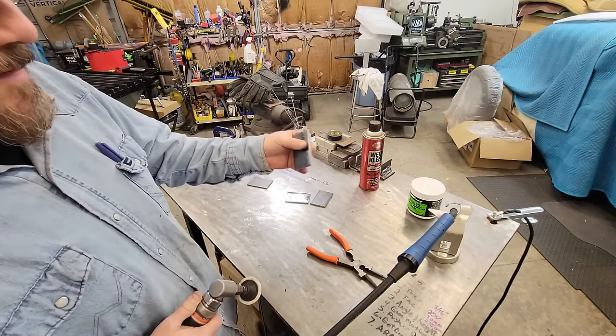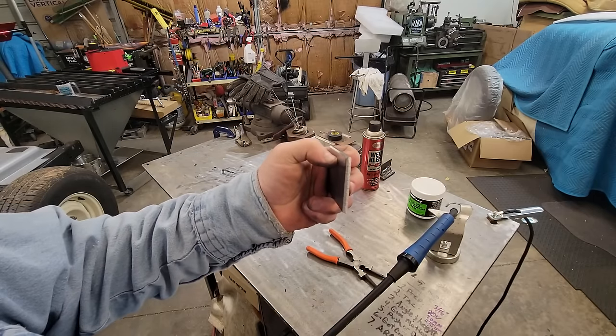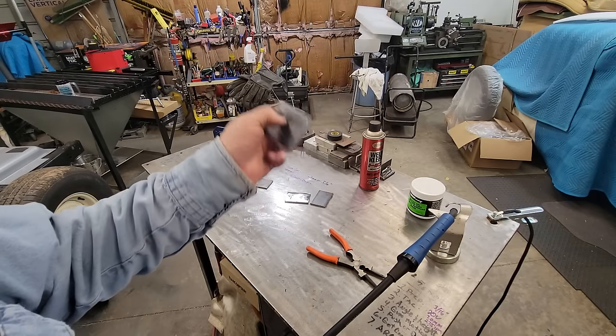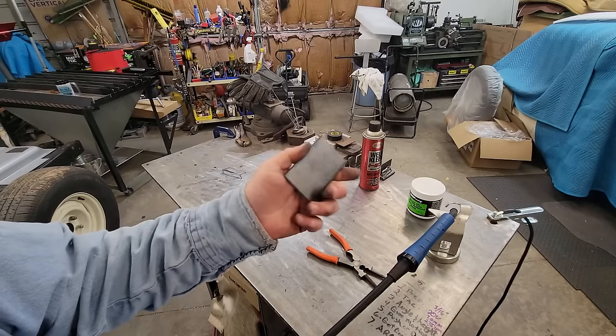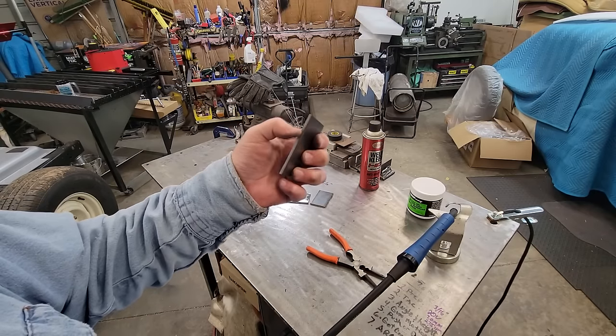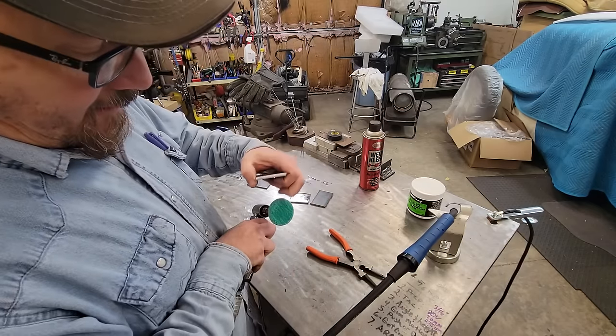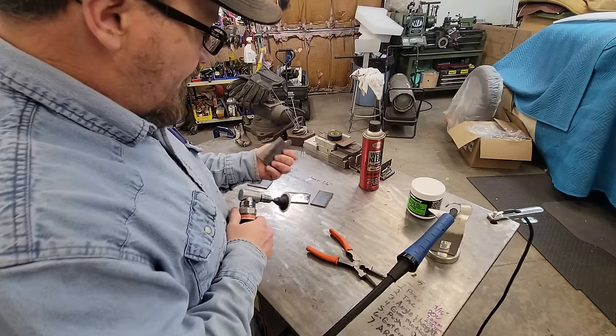Anytime I go up to like 3/16, I do like to cut a little bevel. It doesn't have to be much, but just cut a little chamfer on each side. This helps with the penetration. Now this stuff here, it'll dig like an excavator in some muddy dirt, but you know, every little bit helps. Plus it kind of helps clean the mill scale out of your grinding disc too, because this stuff's hard rock.